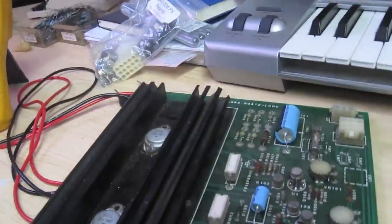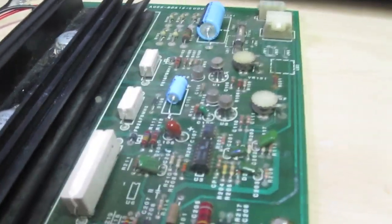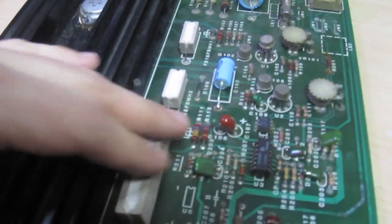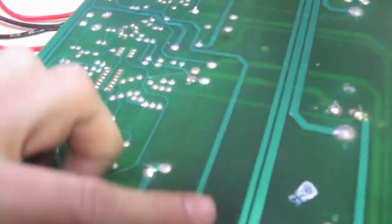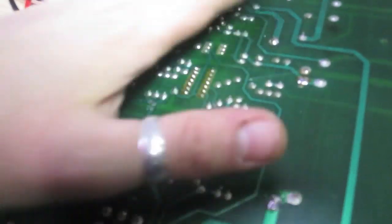I have a little rebuild kit and I'm in the middle of rebuilding it, so what I need to do is desolder and re-solder new components. The idea of soldering is basically this: on this side of the board we've got all these components — resistors, capacitors, diodes, socketed chips, and Molex connectors. These are all held onto this board with solder. This side is the parts side; the other side is the trace side, which has connections or wires connecting all the different parts together, all held on with solder.